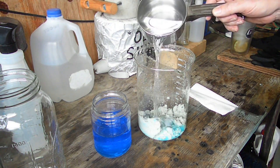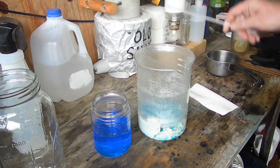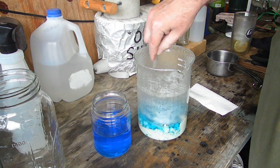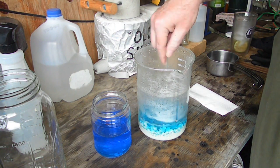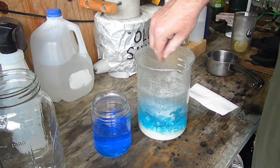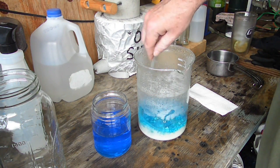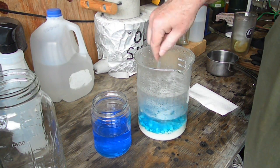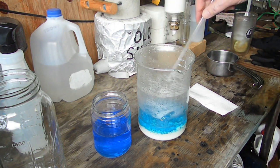I have found that it's better to do several small rinses than it is to do lots of big ones. And you really want your water boiling, because that's going to cause your silver to clump up, and it's going to release any lead, if there was any in there, which there shouldn't have been. But you can see, just adding that little bit of boiling water, we still have quite a bit of copper in there. So I'm going to just let that settle now